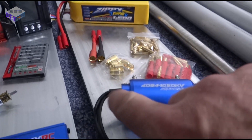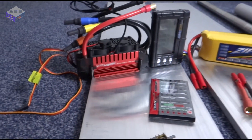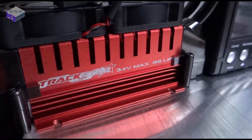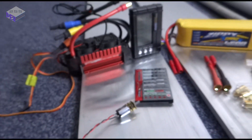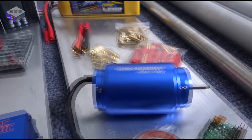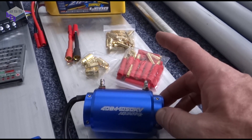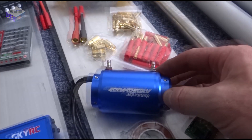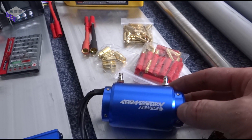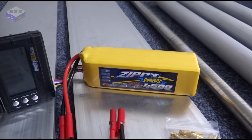Three inputs would be temperature sensors — one attached to the back of the motor, one on the battery, and one on the ESC. The ESC is rated at 200 amps at 34 volts, so there's plenty of power there and it shouldn't get too hot. The boat motor being 3 kilowatts will generate quite a lot of heat, but I can monitor that before I put water through it and then monitor it with water flowing through to see how much cooling I get.